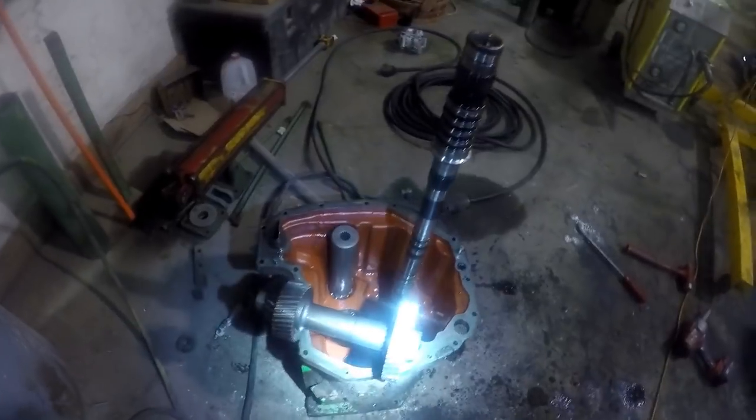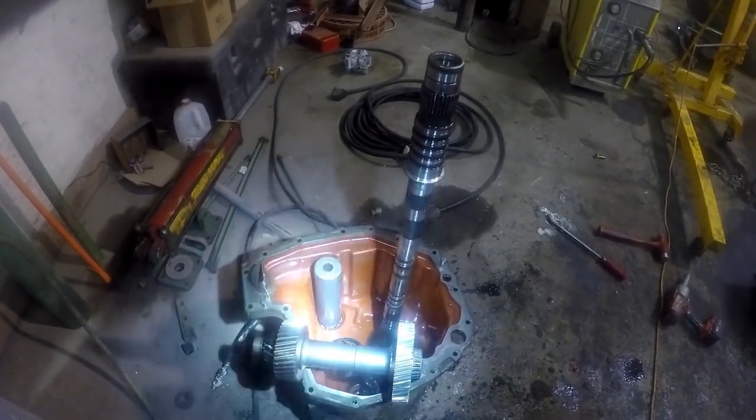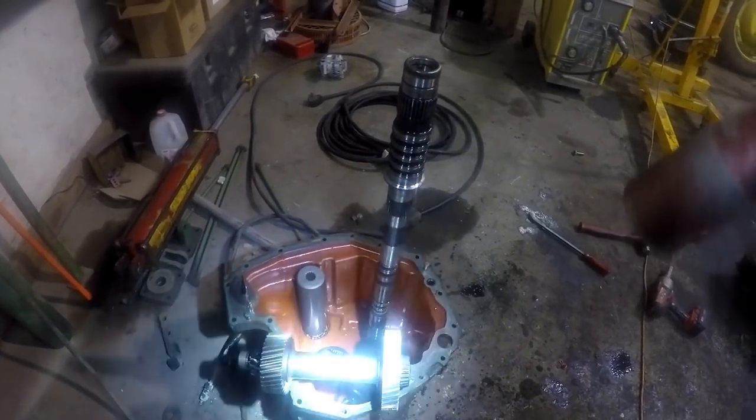I mean, that thing is messed up. I think it seized in there, and it wasn't matching the input and output speeds. Its first reaction is going to be to default back to neutral, and it's not going to let it move. So, yeah, that's pretty wild, huh? And it might have been seized so hard that it couldn't move.